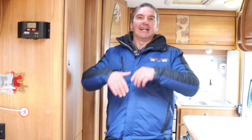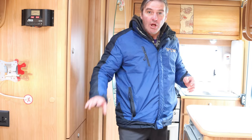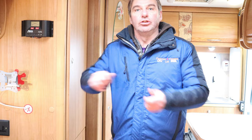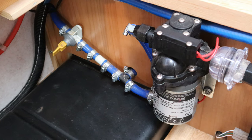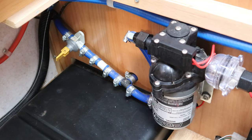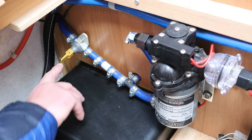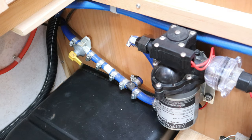We've got to bring water through the system — drawing from the pump, it'll send it into the hot water tank and then to all the taps. The hot water tank is behind the heater under the drawers. We need to make sure the hot water tank's drain valve isn't open, otherwise when we prime, water will come through the pump into the water heater and come out the bottom of the van. Underneath the bench seat we have the water pump and the drain off to the water heater — as you can see it's up, so we need to close that.